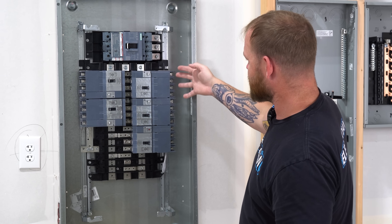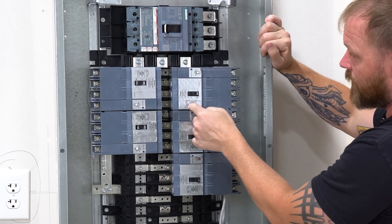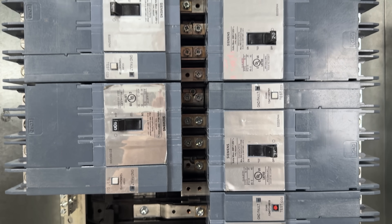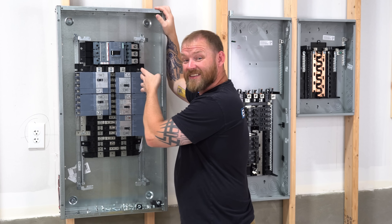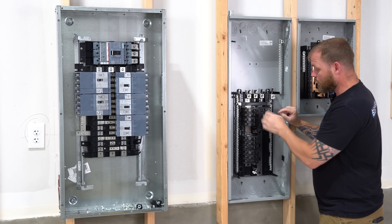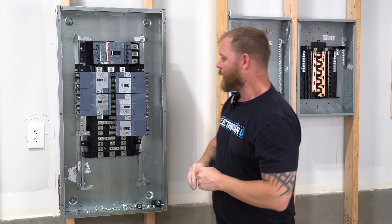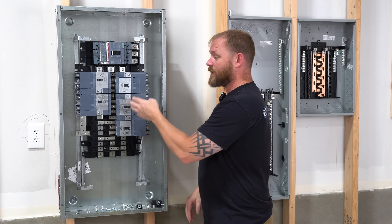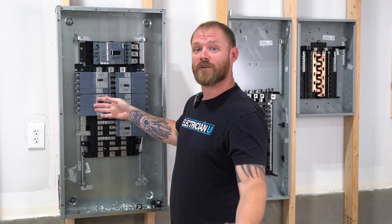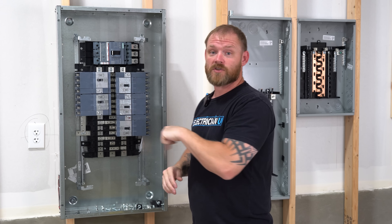You might notice something a little different about these breakers — they look like they're four-pole breakers, with four different screws taking up four spots in the panel. That's because each one of these is a GFCI breaker — you've got GFCI test buttons, just like a normal GFCI breaker inside one of these panels. But with these, they're three-phase GFCI breakers. We're used to single-pole breakers with a little red button for GFCI on a single-pole load, or a two-pole GFCI breaker for EVs or hot tubs. But it's not often that you see three-pole GFCI breakers. These are all 20s, this is a 30, and this is a 100. So if you need a three-pole 100A GFCI breaker, this is a great panel to choose from.